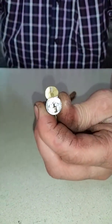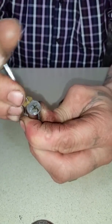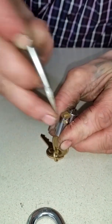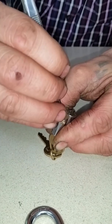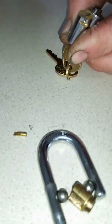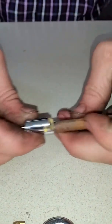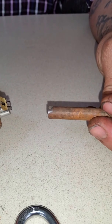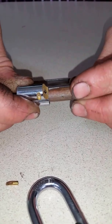I did some pre-work. There's another pin retaining it so you just can't pull it out. Once you pull this out, you're able to extract that out of there, and let's see what kind of pins they have in here, because on the pack it just said it was max lock or lock pick resistance. I have a feeling they didn't do much to secure this lock. I have what we call a plug follower or plug chaser — I made this out of 3/8 round stock. You can buy these professionally made. This one is a half inch that I made out of a bolt — I just cut off the threads and the head. But be professional, go get the real stuff. I'll be doing that eventually. And then I also got some pinning tweezers. Let's make life easy on ourselves. We stick it in here and we just push.